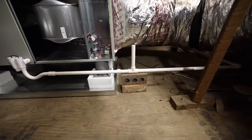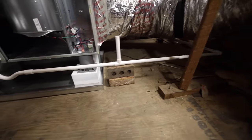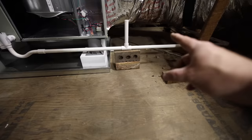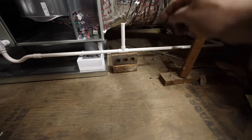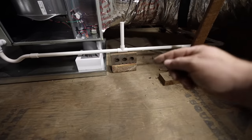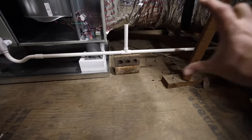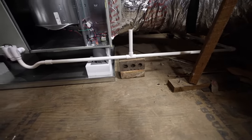I don't have the proper materials to build the supports I want for the drain line going all the way back, so right now I've just got some bricks to hold it in place. I'm going to come back with some all-thread, some clamps, and some standoff brackets so I can secure it down to the floor — all-thread up with some straps and pipe clamps — and I'll be able to make them at different heights to support it every two to three feet. We'll be in good shape.